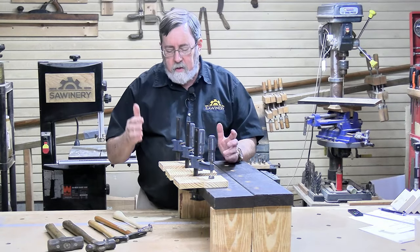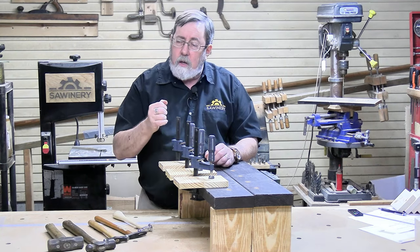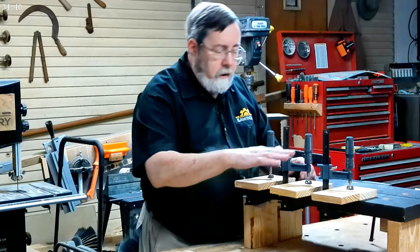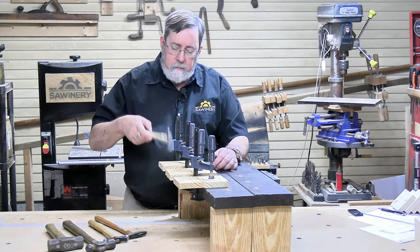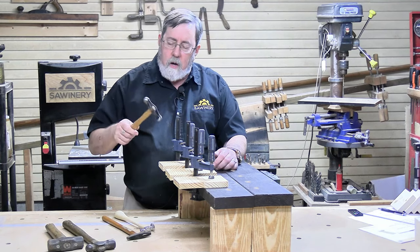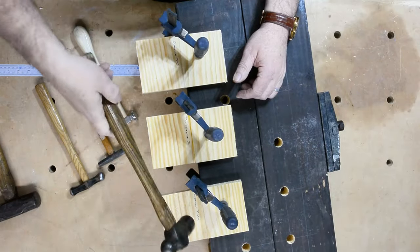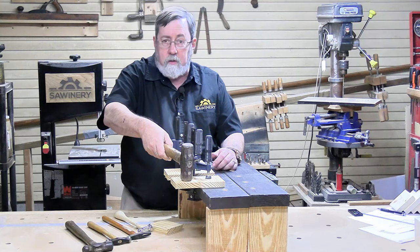We're going to hit each of the pieces and see at what point they fail. Theoretically, what should fail is the wood and not the glue joint — this is pine, not real hard, and the glue is supposed to be stronger than the wood. Starting with a lightweight hammer, then a tack hammer, a double ball-peen, a 16-ounce ball-peen — none of these broke anything. Going to the three-pound sledge: the polyurethane failed. The Titebond held, and so did the Gorilla wood glue. Going a little higher with both of those — the Gorilla also held.